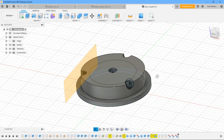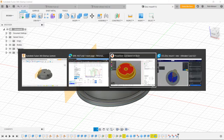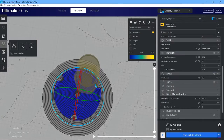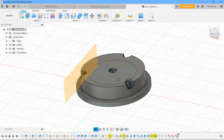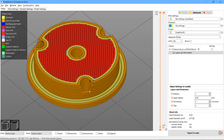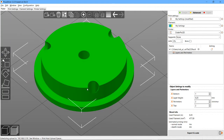It's very small, as you can imagine, because the center of CD, where this CD mounts onto, is quite narrow across the body here. Interesting enough, when I tried to print this in Cura, for some reason, and I really don't know why, probably to do with the material flow and other factors, it's just too globular would be a good way to describe it. Whereas sending it directly to Prusa Slicer, even though it doesn't look as elegant with these sort of fractured edges, this is the actual object as it looks.